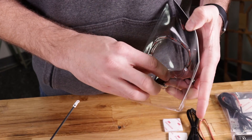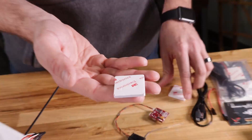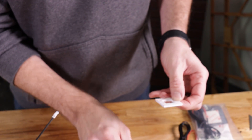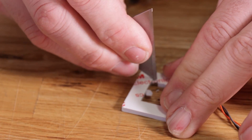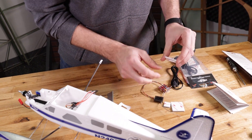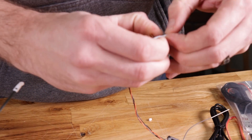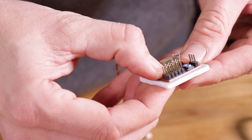Speaking of satellite, let's get our satellite receiver ready. If you're using a conventional Spektrum receiver, this is only about two grams heavier than the whole setup, and even lighter if you decase it or use FrSky. Included in our pack we have two pieces of sticky-back tape. I like to hold on to the center section to mount the spectrum receiver, and I'm gonna cut a little relief so the stickiness grabs all four corners. Simply peel the back off, line it up nice and centered, and put nice even pressure all the way around it.